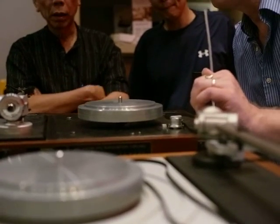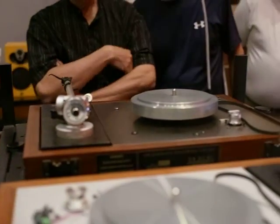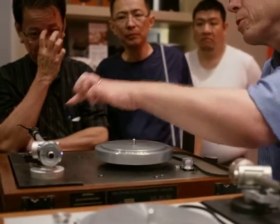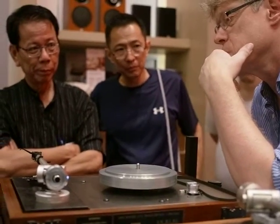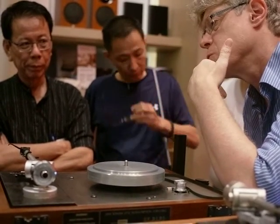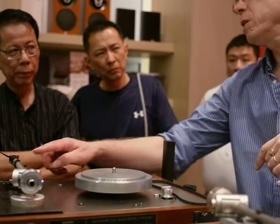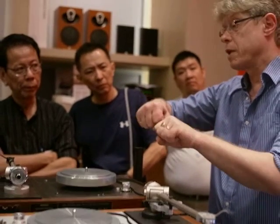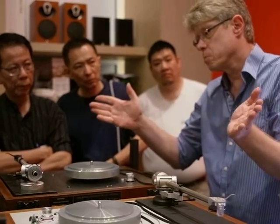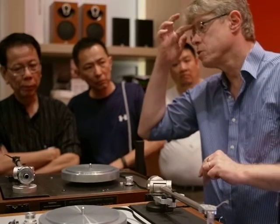This has got, what is it? Is it Clyde or is it Karma? So Karma moving coil cartridge, metal body. That was the first proper metal bodied one we did. We did half plastic, half metal before with the Asak and Asak-T, and then the Karma came along. And it's metal because when you want to get it done up tight, if you go tight on plastic, plastic just breaks. Whereas with metal, you can get a much tighter fix.